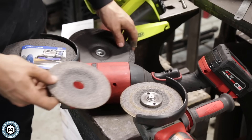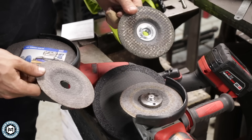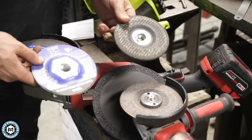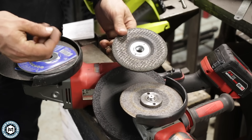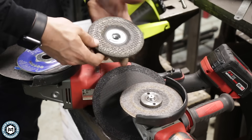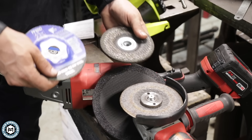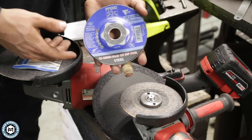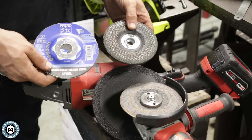As you can see, it's honestly not even fair to compare these two. I wanted to go with something people could definitely go out and buy, and then something that maybe they didn't know about. The results speak for themselves — I couldn't even finish the tests with this disc, because not only did it wear out and was barely working, but my hands and wrists were getting that tingling feeling where everything you touch makes your fingertips move. That's really bad for your nerves. There are rules in the OSHA handbook about how long you can use a tool like this with certain abrasives, because it can cause permanent nerve damage from that much vibration. Happens with jackhammers and sawzalls as well. By using something like this, you're going to save on fatigue, save money, and save time — and they cost the same.